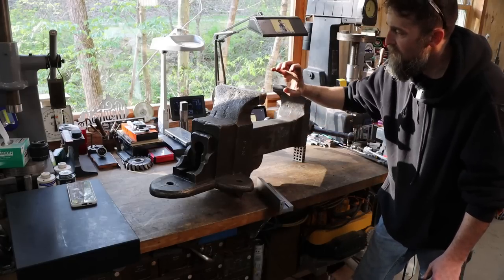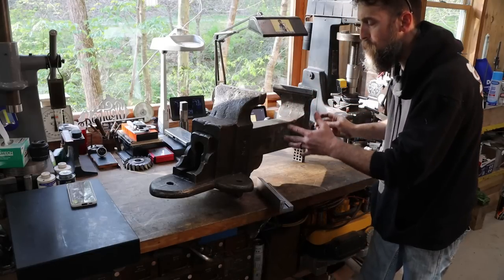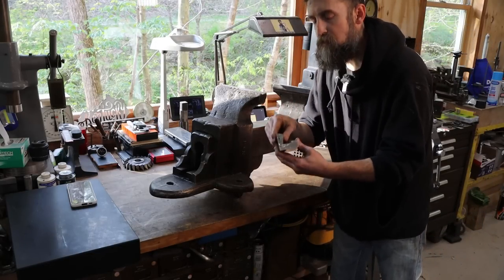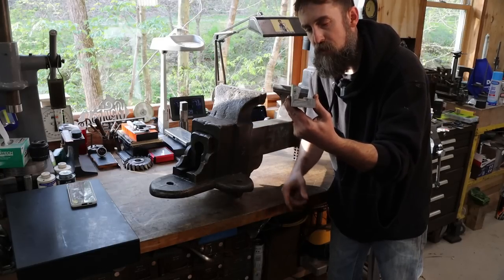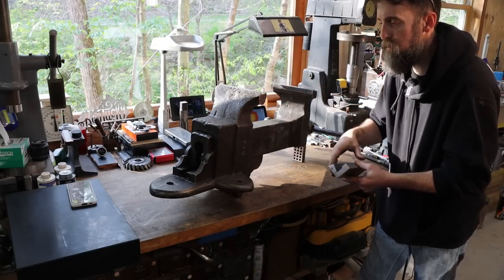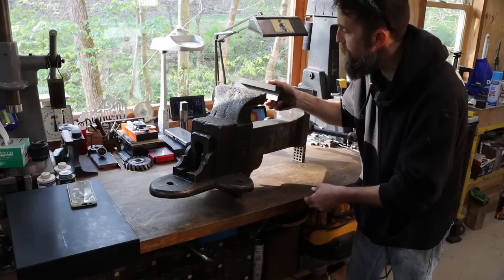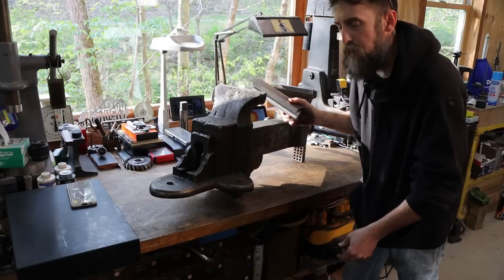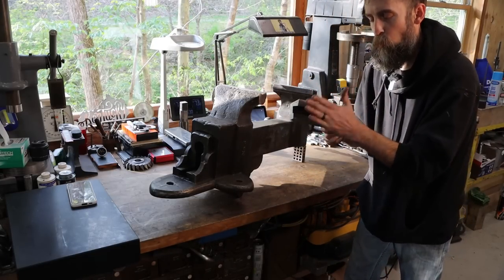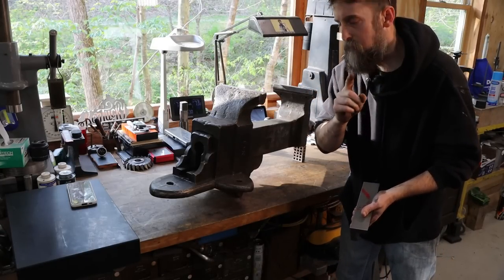I was also told that the jaws on this vise were hand fit to each individual vise from the factory. So in order for me to guarantee that the vise jaws that I made on the shaper in my last video fit, the gentleman who is working on this vise was nice enough to bring it over to me. That way I can make sure and hand fit these to this vise. So let me show you how they fit currently, then we'll go over to the shaper, we'll whittle out a bit of this, and keep test fitting until they fit as good as possible.